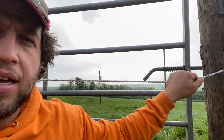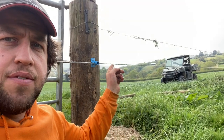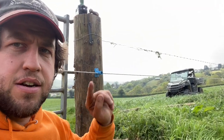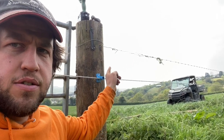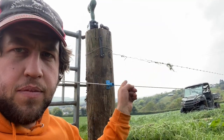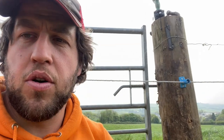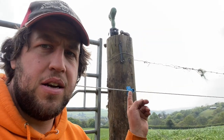This is also using very thick electric rope, because this one will just stay up, and even in the heat of summer this stuff won't stretch very much — that's why it's up. I also left seven inches between the barb and the electric. I didn't have enough high tensile to finish — I do not know how, because it's the same length of fence — so I've done a bit of a bodge with some wire until I find one of the rolls of high tensile, which is on the farm somewhere.